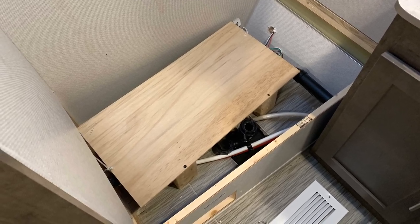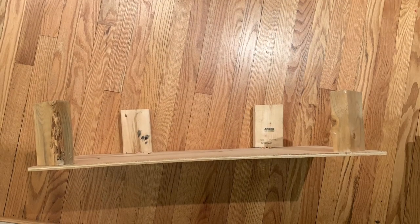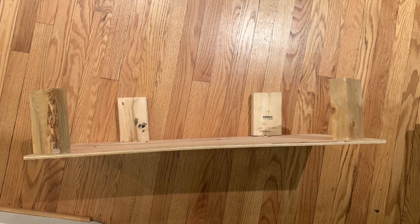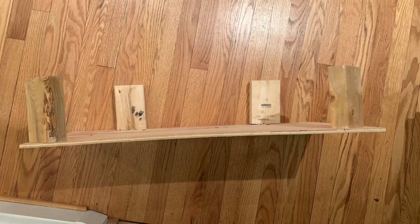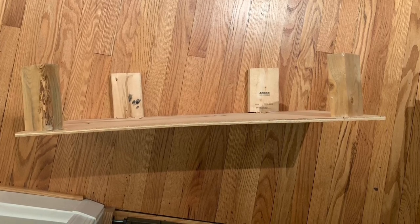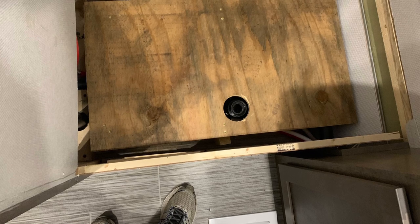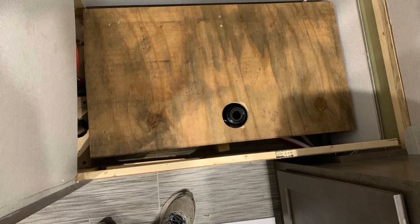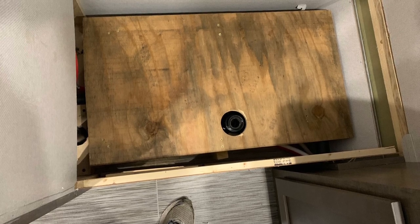The way they construct these is with a piece of quarter-inch plywood that doesn't even cover the entire floor surface area, supported by four two-by-fours set up as posts at the corners. I just thought this was a really inadequate design. Here you can see a photograph of the floor showing just how incredibly cheap it is — that's why when you walk on it you feel like you're walking on a waterbed. I added six posts supporting a piece of three-quarter-inch plywood. The posts had to be a little bit shorter to accommodate the thicker wood, and I also cut a proper hole in the floor for the drain pipe so you get good solid support throughout.